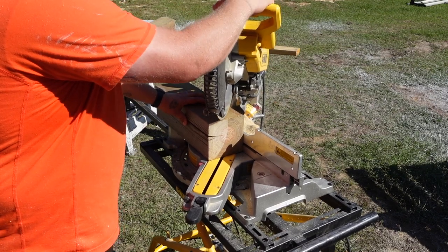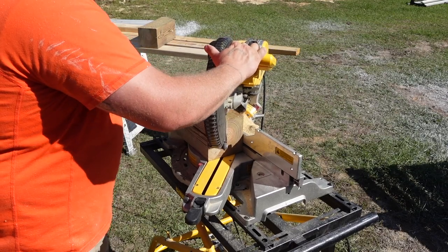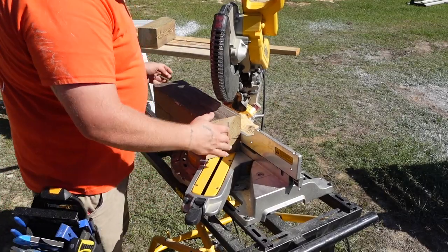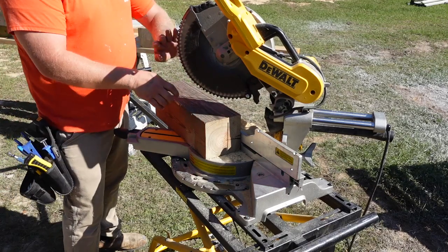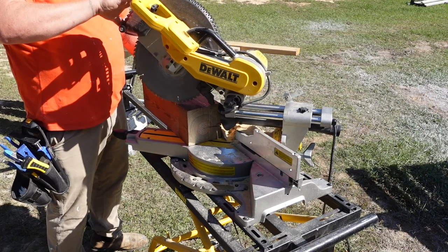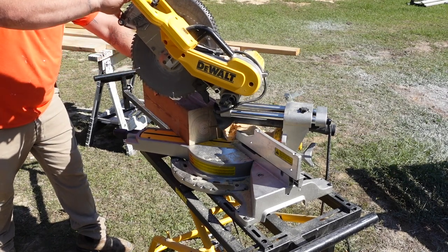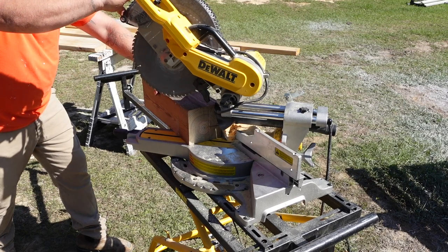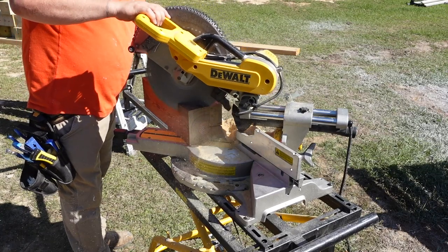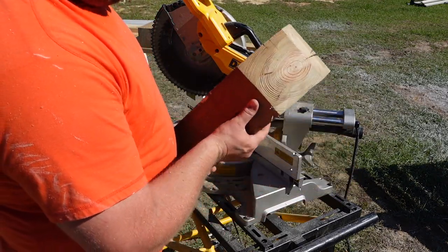When you cut it, give it everything you can. Then you flip it over — this is where the trickier part comes in. What I like to do is roll my fence here, get my saw close, and then if you eyeball down the fence you can see your original cut. You just want to get it straight — and there we go, nice and smooth.